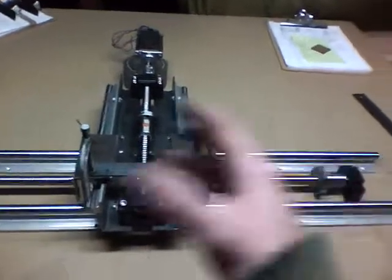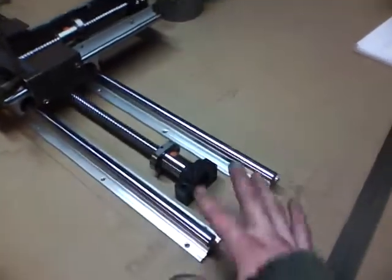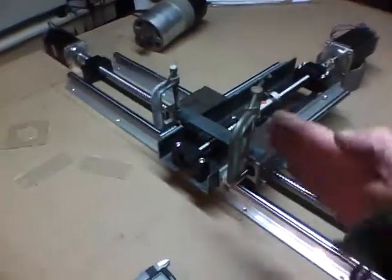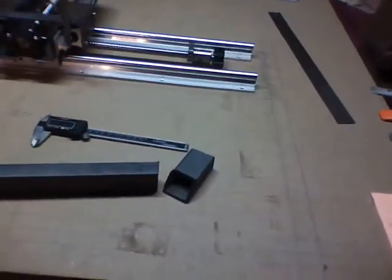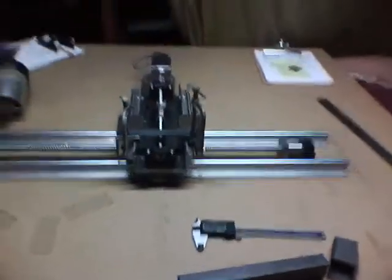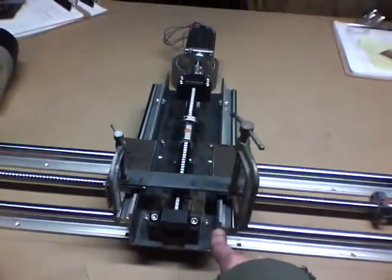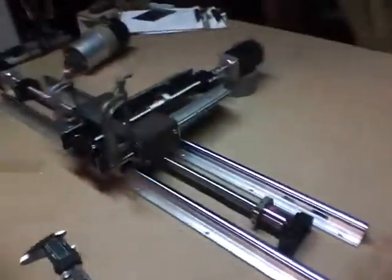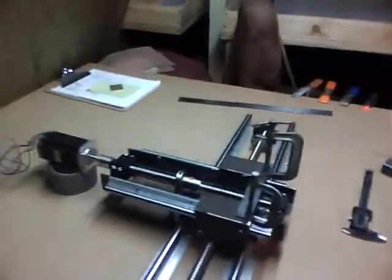Design is finalized - I just got to make it fit, so I'm going to rebuild that tomorrow. I've got the gantry rails figured out, just need to widen the actual rails. The height of the rails off the deck accounts for two layers of MDF as the actual deck, and I've figured out the travel of Z and how far the router sticks down. Making some progress - I'm much happier than I was yesterday and not really bummed about having to rebuild this. It's just going to be a whole lot of drilling. Day two, not bad.